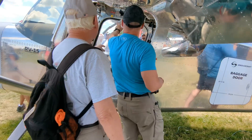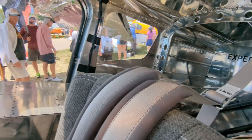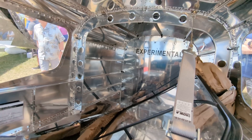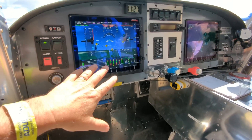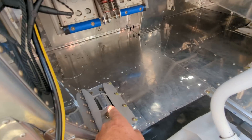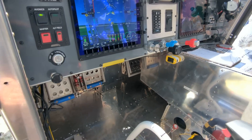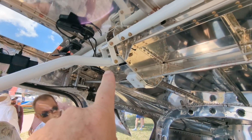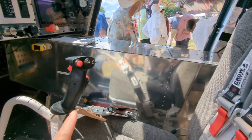We'll have to wait in line here to look inside the cockpit. You're going to have your typical stick controls, two seats side-by-side with loads of room for either a sling-type seat. You could put people back there, but more ideally you'd want a lot of cargo space for things like mountain bikes. The fuel tank is just part of the prototype, and you'll go with a modern instrument panel. Traditional toe brakes right up there. The pivoting point for the gear and those TK monster shocks are mounted down below the floorboards in the fuselage.